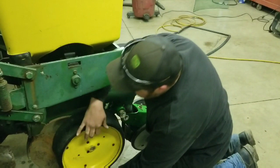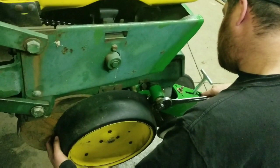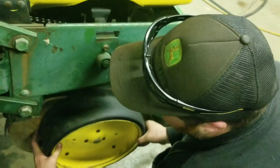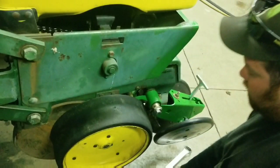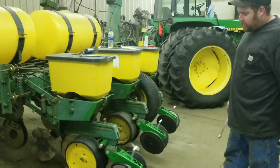This one is just a hair loose. What we're going to do is take an inch and three-eighths wrench, loosen this up, make sure that's a little loose, and then turn it in just a little bit, hold it up a little, and turn it in just a little. That feels perfect right there — it's rubbing just a little bit, it's perfect. So all we're going to do is tighten our bolt up, and by the time you tighten that up — perfect. Just finish tightening it the rest of the way, and that's all there is to it. Now it's as tight as it's going to be for the age of the planter, and nothing's going to get pinched in there.